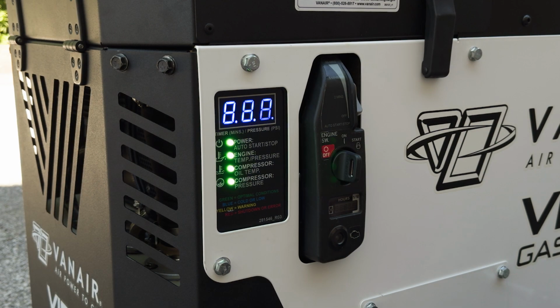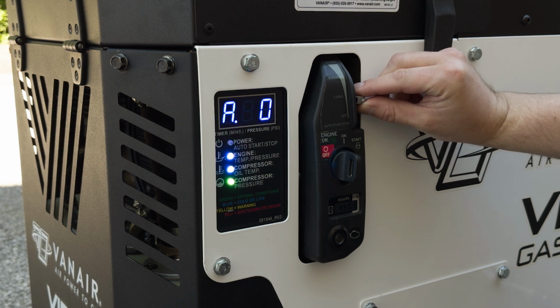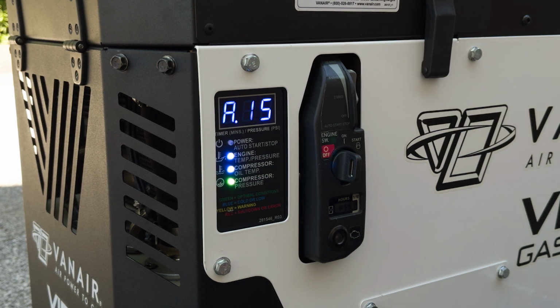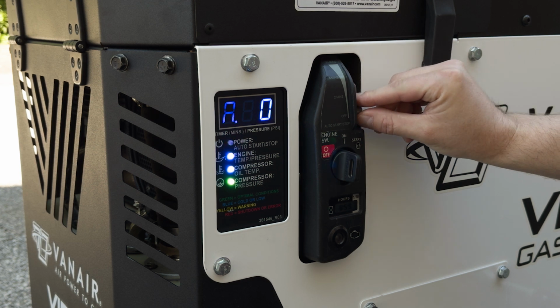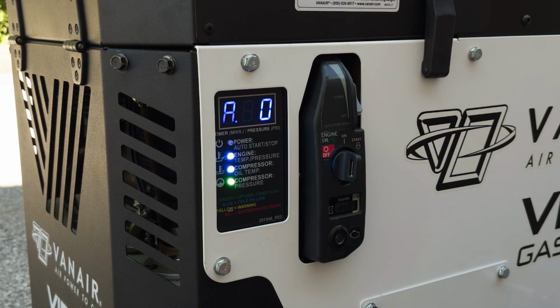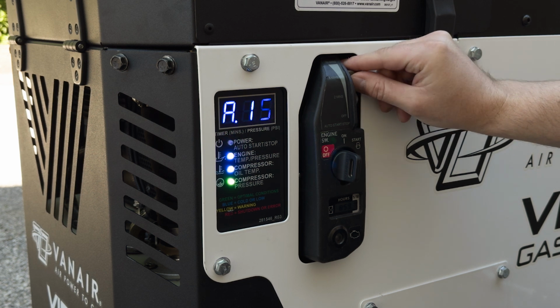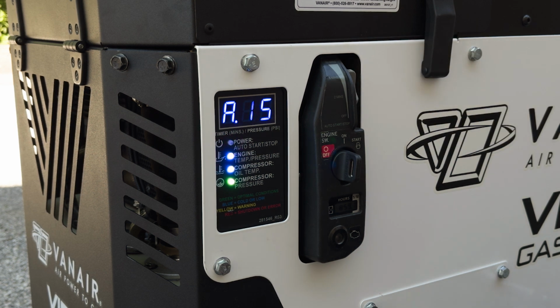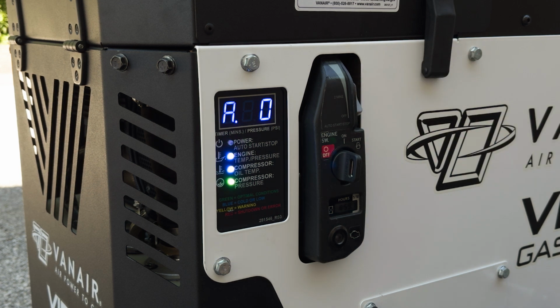With the machine off, turn the key to the on position. Do not crank start. The screen will display an A, followed by the number of minutes that auto stop will occur. A 0 is the auto start-stop off position. The auto stop time is now adjustable using the adjustment lever. Set time will automatically appear after 3 seconds.